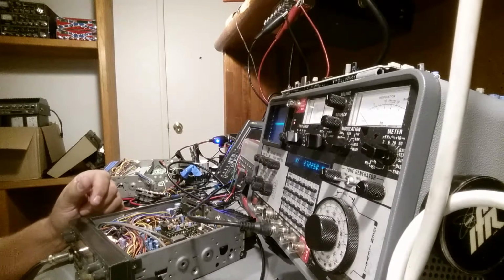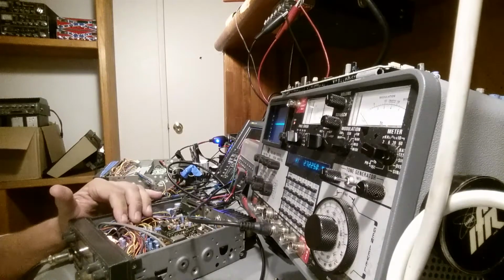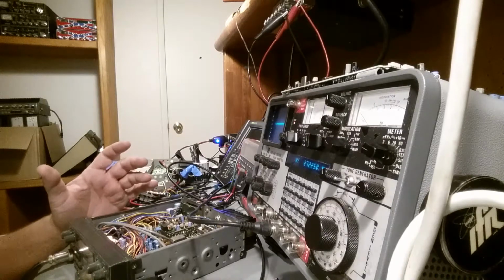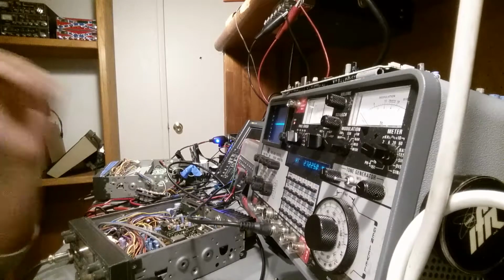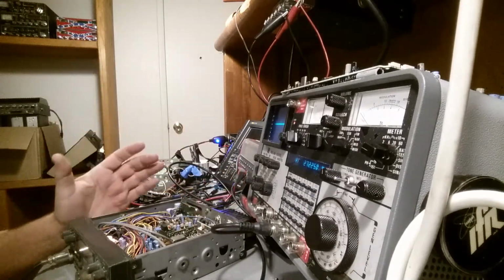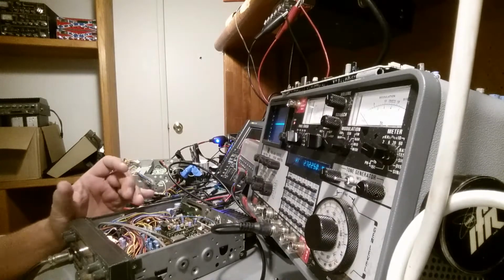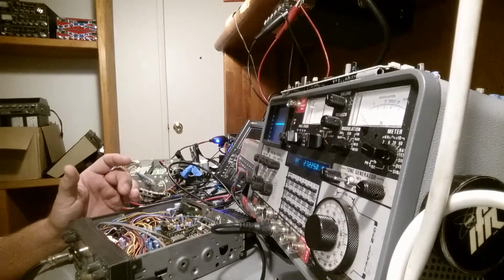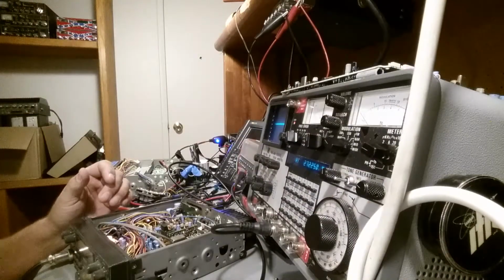I've been tuning these radios. One that's easily adjusted. Some don't. Some have kind of a coarse frequency adjustment on the VCO. But when I can, I've set them so they're only off by 25 hertz. So you have 27 megahertz, and it's only off by 25 hertz. That's such a tiny percentage, it's almost ridiculous, but if you can, why not? I remember on one of the radios I did, the VCO adjustment was just loose. I know over time you bump the radio and it's going to change it. So that one had to get some of our famous Glyptal on it to hold that in place.